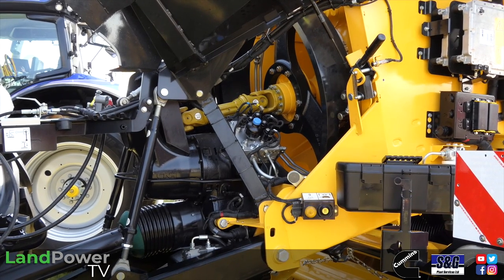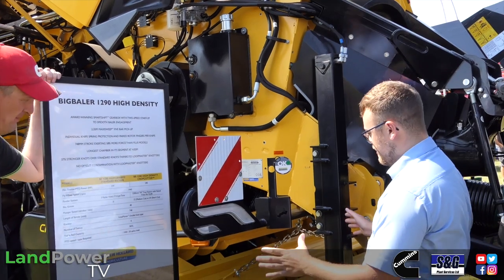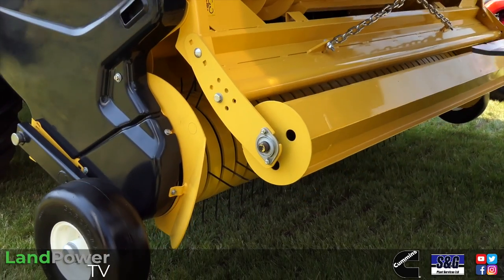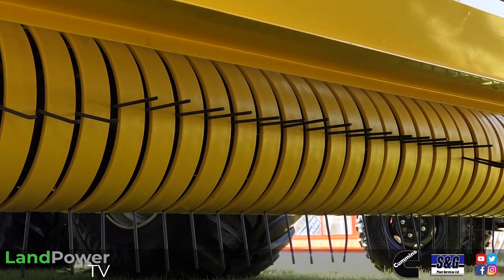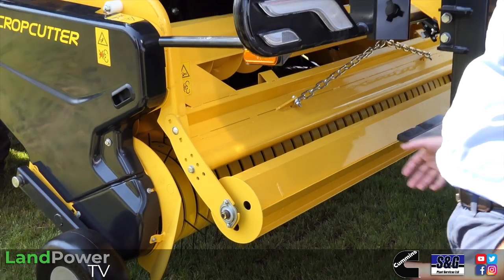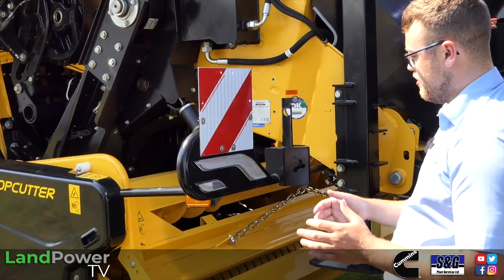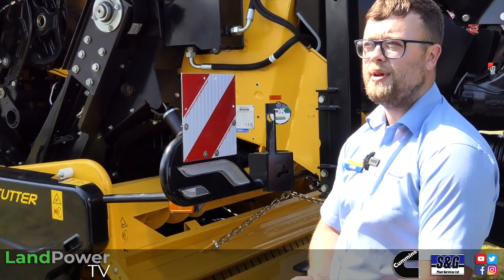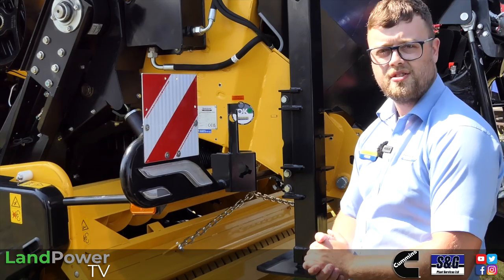This has a larger flywheel than the Plus range — everything is beefed up. There's a five-tine cam track pickup — the active sweep version — working really well with plastic tine bands for quiet smooth operation. The benefit over a camless reel is the sweeping action, giving better feeding and presentation of crop up into the rotor. You can run it a bit slower — around 124rpm — ensuring no crop loss behind. It's 2.35 metres wide — a generous, wide mouth with a big appetite.